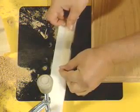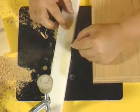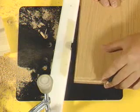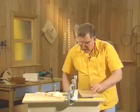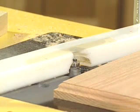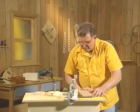And we'll make that a fairly large one. We'll see if we can get the center on this one here, and that's going to give us a position. I want to see how much I want to start and stop here, so let's take a quick look at this. Well, I need a little bit more than that, so we're going to find our stop point here, find the center. I'm just going to guess it right now, but you can go ahead and mark it and make the center perfect here, but I'm just going to show you the process. We're going to drop the cutter down first so that we just have the cove part of the tool now, and that gives us a little bit of a cove part, and let's go ahead and cut it.